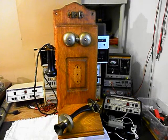We also want to replace the receiver capsule cord. It's been on the telephone a very long time. It's brittle and it is bad, and we're going to replace it with a black rubber cord. We're going to keep the look of the telephone because it's been like this for a long time. We're going to try to utilize the receiver capsule. If it's good and it troubleshoots to be good, then we're going to go ahead and use it if it's loud enough and there's enough volume. If not, we will upgrade the receiver capsule on the inside.